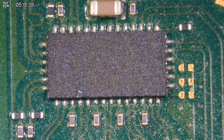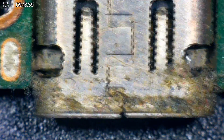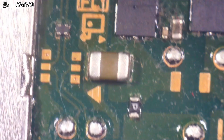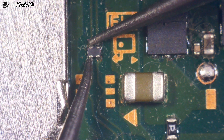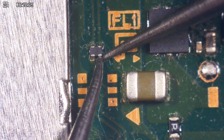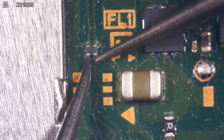And if we look at the back as well — P13 USB — on the face of it this looks fine with no issues. Everything looks okay, so we're just going to test for some shorts. The charging port itself looks a bit done in but I think it's okay. Meter in continuity mode. First thing we're going to check is the fuse just above the charging port — we get a beep, so we know that's all good. We'll check this filter here — that's fine. They're not connecting. That's fine. So that filter's good as well.